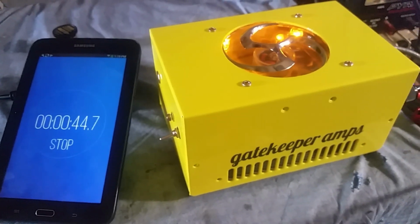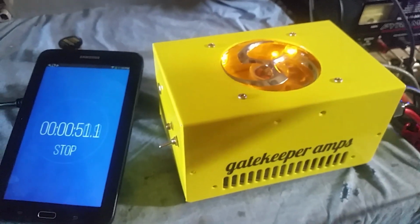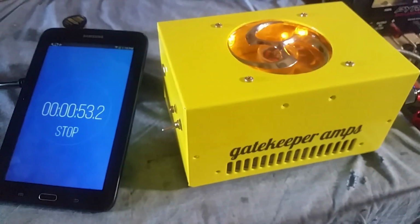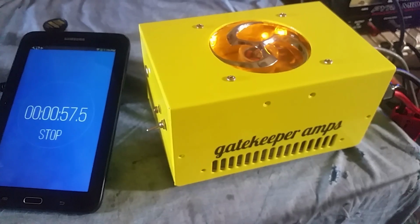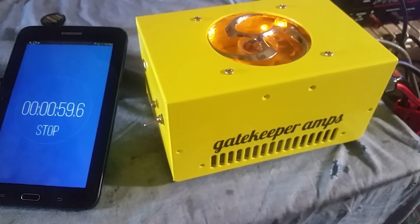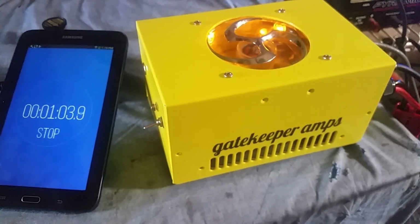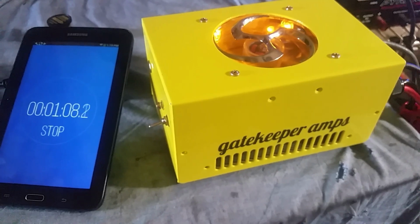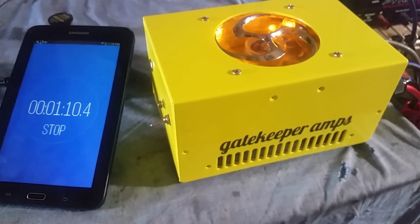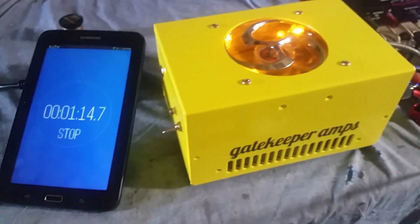So as you can see right now, the power is still on over here, okay? The power's got to be on, because that's actually how the fan is spinning. If I went and turned that power off over there, the fan's going to turn off, okay? The fan is being powered by the electricity that the box is hooked up to. What this is doing is putting a delay on the actual relay that's turning the fan on. The fan is on an actual relay, okay?